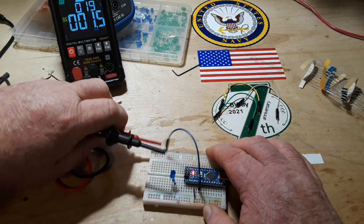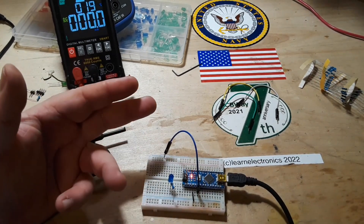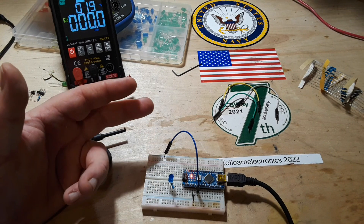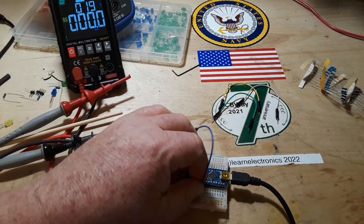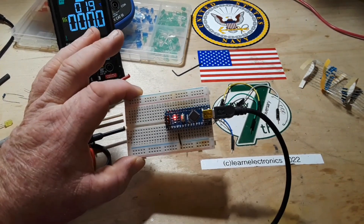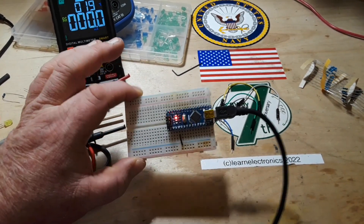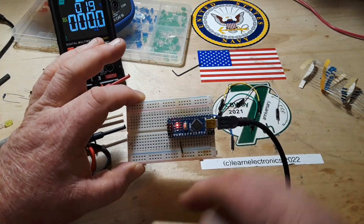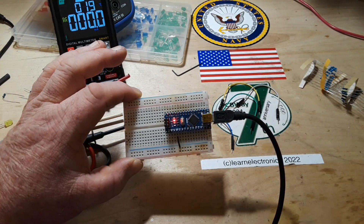So we're looking at roughly 6.7 plus 18 — so about 25 milliamps total on the entire Arduino. That in itself is not bad at all. I guess what I wanted you to get from this was just pay attention to how much current you're asking the Arduino to either source or sink. Source means to put out, sink means to absorb in. We'll get into more of that later.